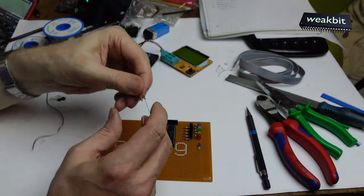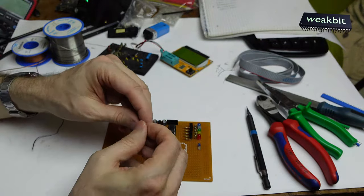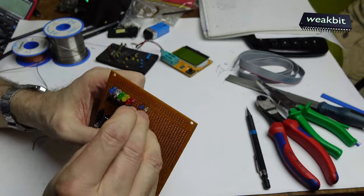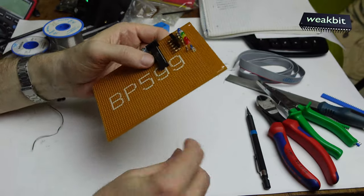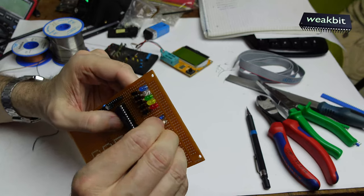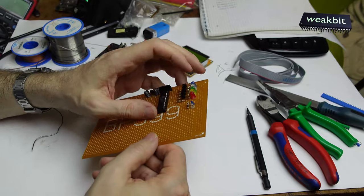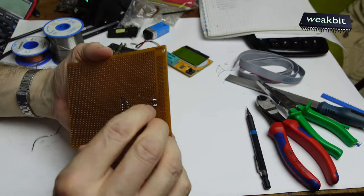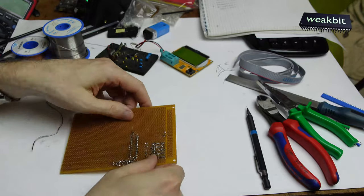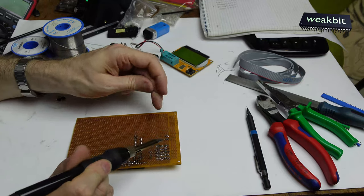We take that away, take the resistors, bend them, and build them in. The breakthrough voltage is the same as the other big blue and the other white one. It's also 2.522 and 2.549 volts. Yeah, we must hold this here, bend them back, and solder them. This is what we are going to do.